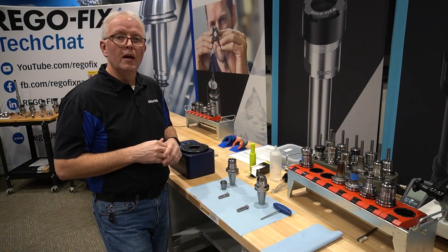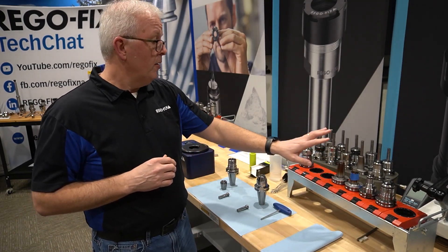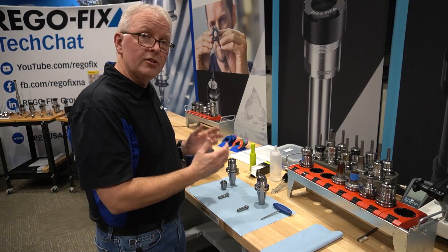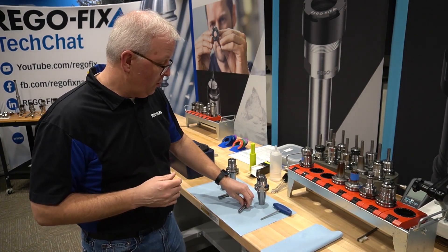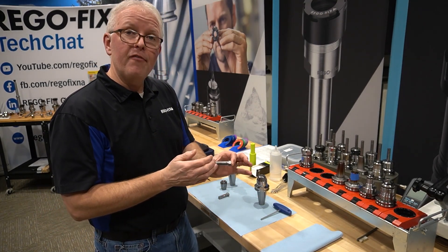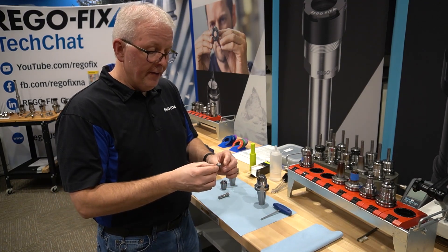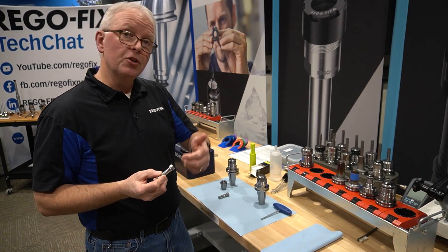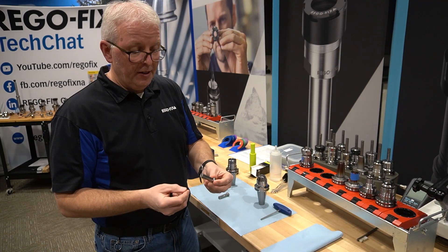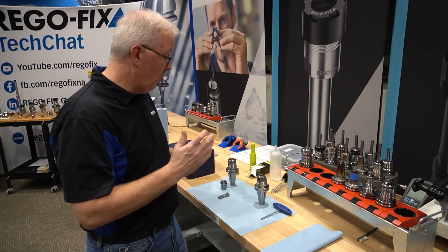So let's take a few minutes and let's see for ourselves. As a quick example of how we went through and cleaned all of our tool holders — whether they be PowerGrip, Shrink, or the ER products — all the tools are using a half-inch pin. This is an H6 maximum diameter, so it is almost exactly a half-inch size. They are 50 millimeters in length and they have a 16 millimeter head size that allows us to hook it to our load meter to get our measurements. These are all made out of high-speed steel and they are highly polished, so they're very consistent from one to the next.